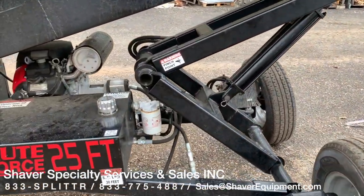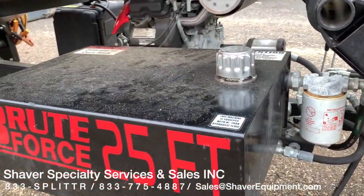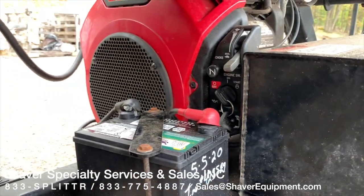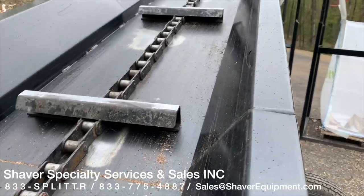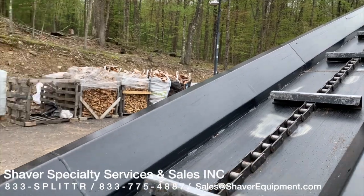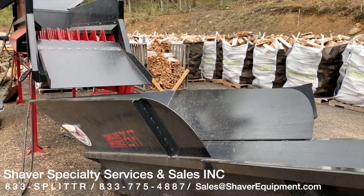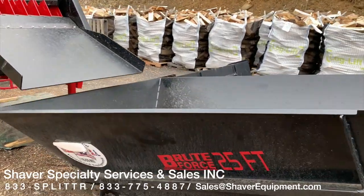So there are the remote lines coming in behind the hydraulic oil filter. Nice big reservoir tank for the hydraulic oil. It is electric start. Single drag chain, top drive hydraulic motor. We did put the larger in-feed hopper on this because it's coming off the cleaner, and that way I can make sure everything makes it in there no matter what angle we've rotated the conveyor to.